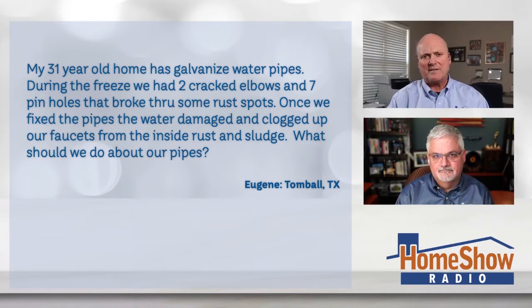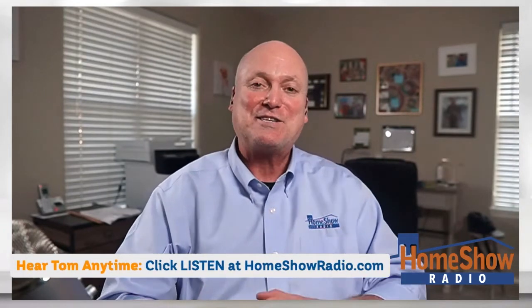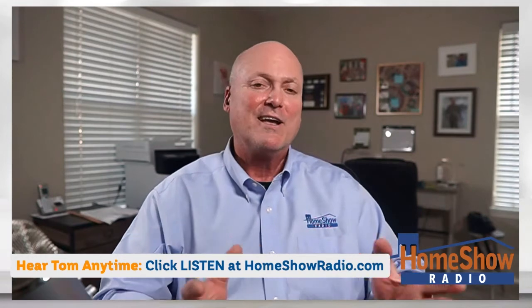That's a timely question in the Tynan house. After we drained our pipes, didn't get any breaks, put everything back together, someone comes to me and says, I don't have any water pressure in my shower. I immediately took the shower head off — it was full of junk. I cleared it out and she said she'd never had such great water pressure. All those areas in the washing machine, the aerators on the sinks, the back of the shower heads — they're full of junk because so much stuff got dislodged. And when you turn the water back on, it's going to move that stuff around. Everybody's going to go through that.